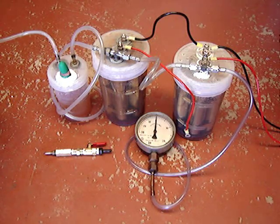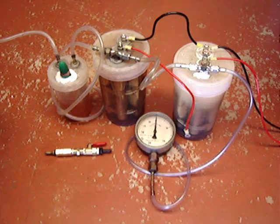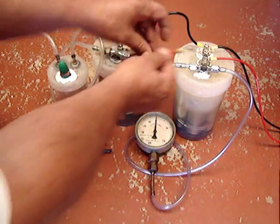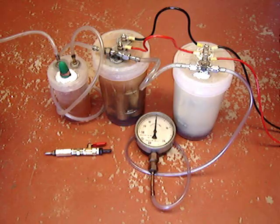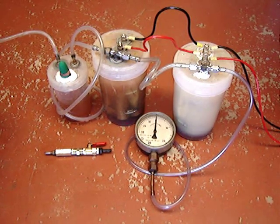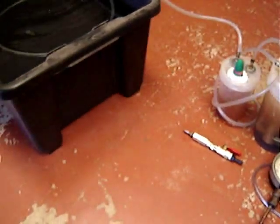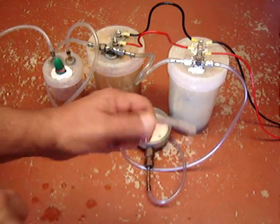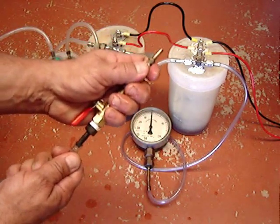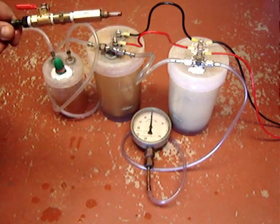The final stage is connecting the torch up — power's on. This is 12 volts from a PC power supply. It doesn't like starting up with two cells connected so we'll hook the second one on once it's up and running. Those PC power supplies tend to play dead if they're overloaded to start or near the limit, as this one is. Now the system's going — the outlet from the bubbler is going over into a water tank that I use for pressure testing the whole system of vessels. Take that hose out, connect the finished torch up and that gives you an idea of it.